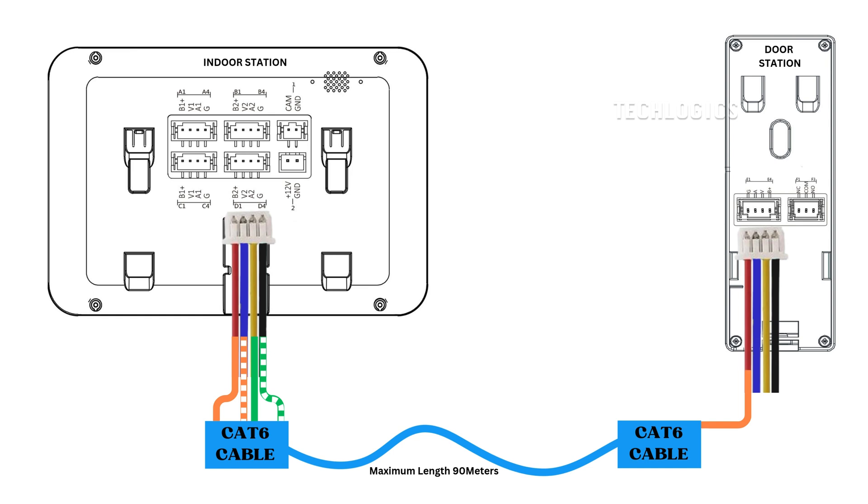Note: if your 4-pin connector has different color codes than described, refer to the corresponding colors of the CAT 6 connections while maintaining the same functionality. Just match the corresponding colors of the CAT 6 wires to ensure correct connections.